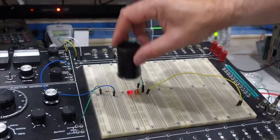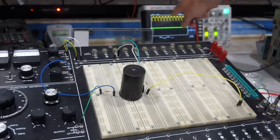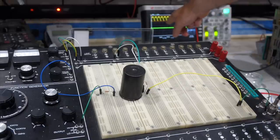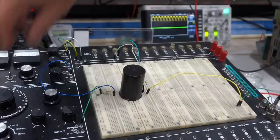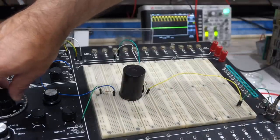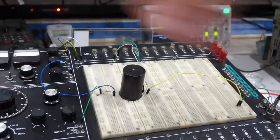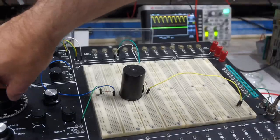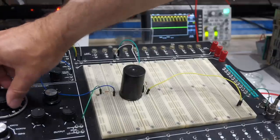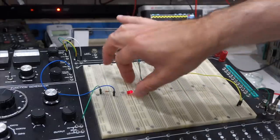Okay, it's pretty weak, but if I put the cap on it, you see that the weak one gives me half the signal, which is the problem. However, it's not because it's that weak, it's because it's slow. So if I go to much lower speed, it's fine. So it's just that it's somehow gotten too slow.